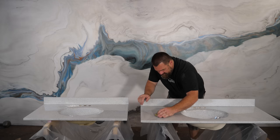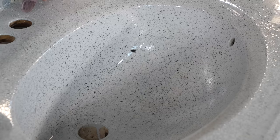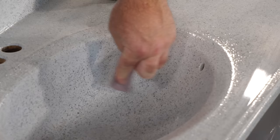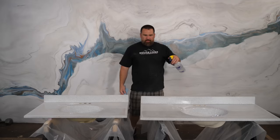Coat one is dried perfectly. I'm going to lightly sand with 220, clean the dust, and then apply coat number two. Just a super light scuffing is all that's necessary. This is going to create a nice mechanical bond for the next coat of epoxy on edges and surface. I'm putting another coat on. There's a fly that's stuck in here because we left the door open. Just sand it all the way gone — look closely because their legs will stick in there. Gone. We're good. Next coat — never know that the fly took a kamikaze trip into the countertop.